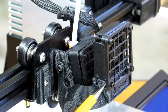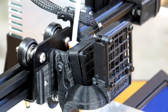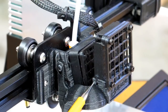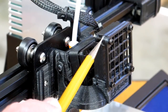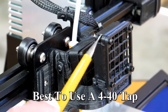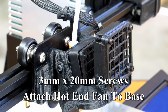On this one I drilled and tapped it for 4-40, but that's entirely too big for the application — don't do what I did. Drill and tap the ears for 2-56 unless you have access to 2mm. The length of this screw is three-quarters of an inch long. That holds the fan guard in place with the spacer, and 4-40 will thread into the ears of the fan just fine. The 3mm screws that hold this onto the base are 20mm long.